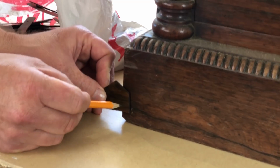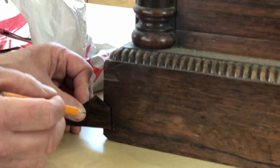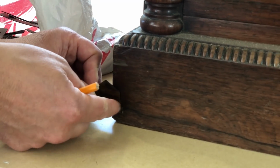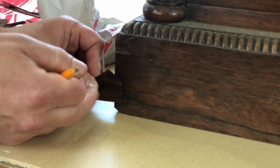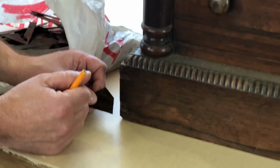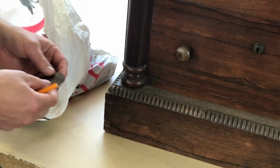Now it's slightly lighter, which is just what I want, because then I can colour ever so lightly, a little bit of tone, a bit of French polishing technique using pigment powders and spirit colours, just to pull the colour through and make that disappear. So that's what we're going to do next.